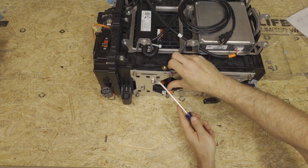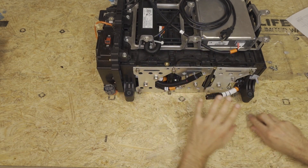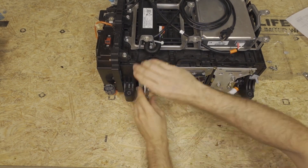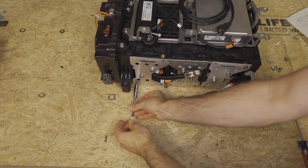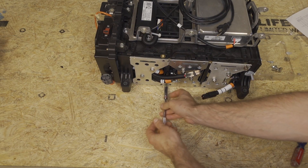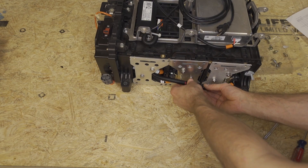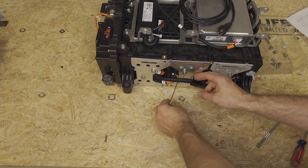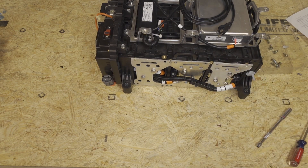Make sure that the tops are completely flush. As soon as you get these all to line up, tighten these bolts. Now we're going to unscrew these bolts — if they're really tight, you're going to have problems putting the air shroud on. If you need to push it one way or another, you can remember that and adjust when installing the air shroud. With these bolts out, plug in the black Anderson connector, then I recommend taking a zip tie and zip tying this Anderson connector.